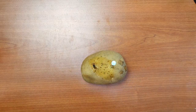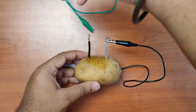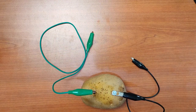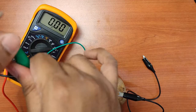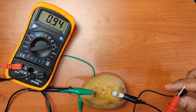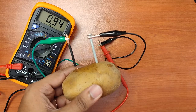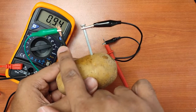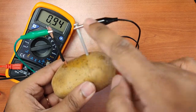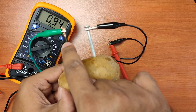So what happens when we connect this to a voltmeter? I'm going to connect one of the connecting wires to the nail, and then the other one to the copper wire, just like this. So now we are going to connect this to a voltmeter to measure the EMF produced. You can see we have an EMF of 0.9 volts. This zinc is more electropositive than copper, which means zinc will donate electrons. So zinc is going to act as the anode — electrons are going to come out here and go through the wire — and then come into copper. So copper here acts as the cathode; copper is where electrons are accepted from the external circuit.